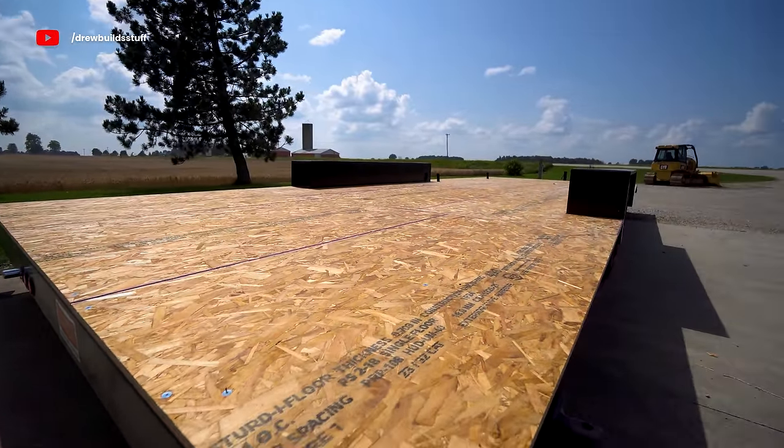Notice I left a good couple feet overhanging out the end of this board, and that's because I'm going to connect this with one more rafter up to the ridge beam and be the overhang of the roof. Now I'm going to create that overhang, so I'm measuring out how much that ridge beam is protruding out and then transferring that onto the fascia board. Then I'm cutting up one more rafter using that same old template, but not cutting in the bird's mouth this time. And screwing and nailing that in to be the fascia board of this gable end.